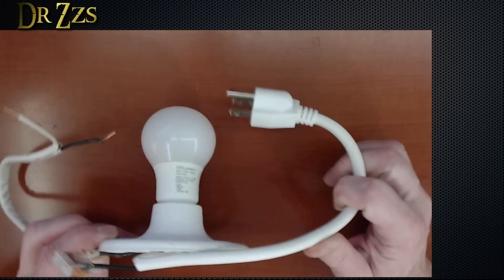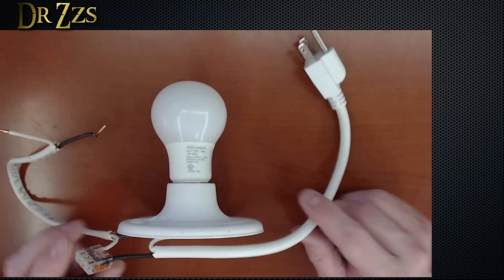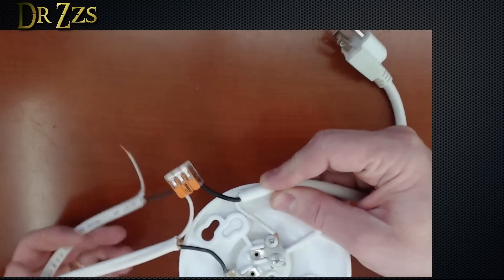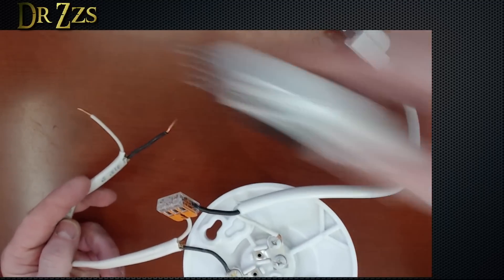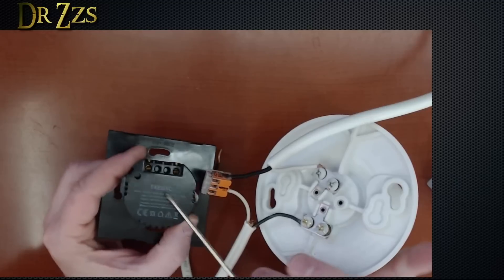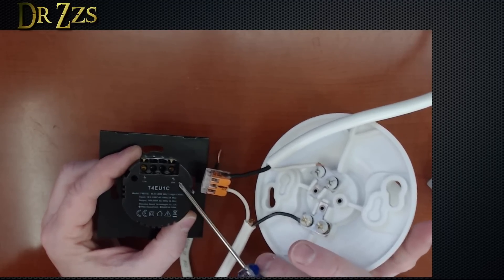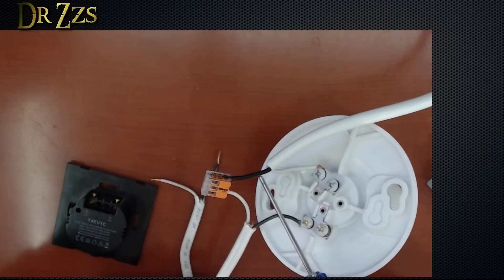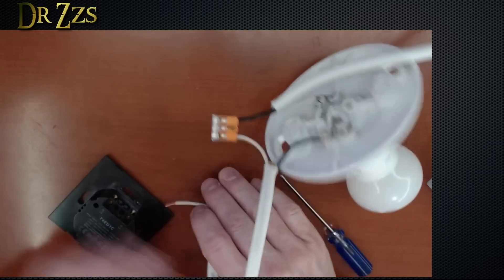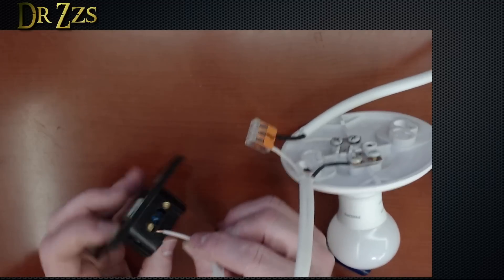This no-neutral required switch — or single wire switch — works in a situation where the power comes in to the light and then two wires go out to where the switch is, and it would have been one of these old kind of switches. On the back of this switch there are two contacts: line in and line out. In the example I've wired up here, I put the hot wire to the white wire. As long as the hot wire goes in on line in, you're doing it right.